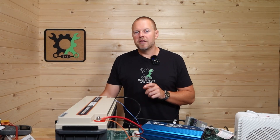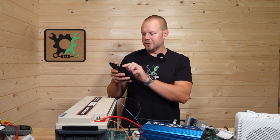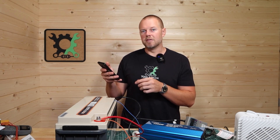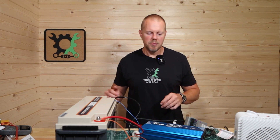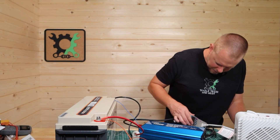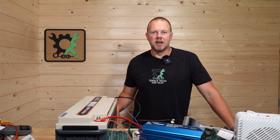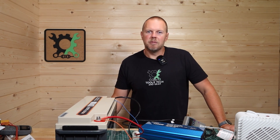We've got 590 watts and 44 amps draw. The battery is at 13.3 volts and we've used 9 watt-hours so far. The kilowatt meter shows one minute elapsed. At 2,432 watt-hours divided by 590 watts, that's about 4.1 hours of expected runtime. If I return in about three and three-quarter hours, we should see this thing dropping down pretty low. After three minutes, the meter shows 188 amp-hours remaining, so we've used about 2 amp-hours. Our test is underway.